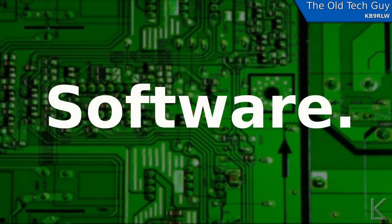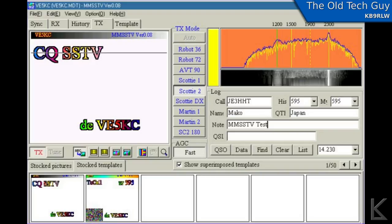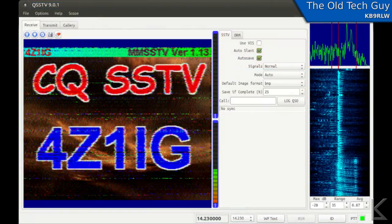So what about software to allow you to experiment with slow scan TV? Well, there's free software out there. I'm going to talk about 2 packages real quick. On the Windows side of things, there's a program called MMSSTV. It's freely available, and the link will be down in the description. It does most of the slow scan TV modes for Windows just fine. Lets you compose images as far as adding text within the program, and transmit and receive and maintain a gallery of images. Under Linux, a free program that's available is called QSSTV.